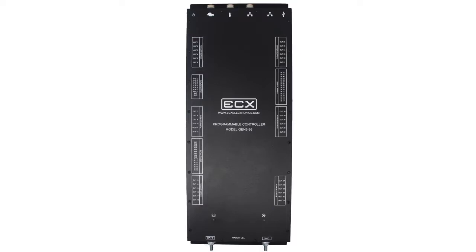This is the ECX Electronics Multiplex Control System. It includes the following features: 36 20-amp power outputs that can be independently configured to be active at 12 volts or ground. These outputs can also be independently programmed for PWM operation to control motor speeds.